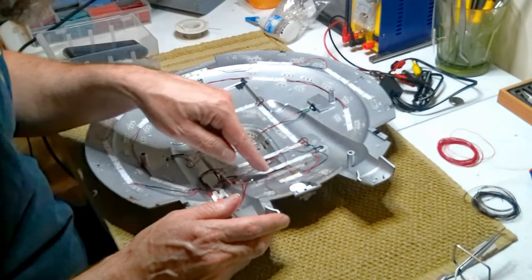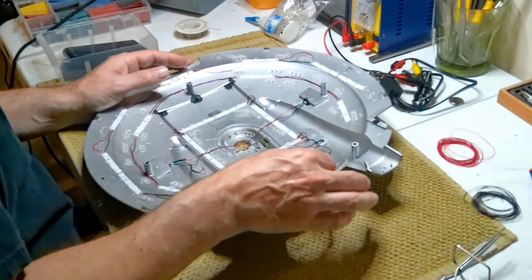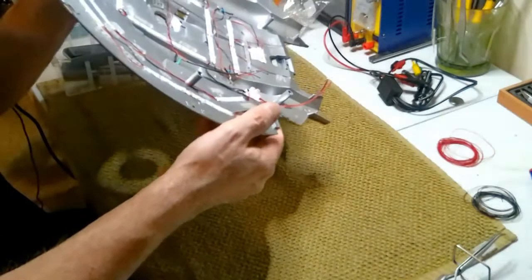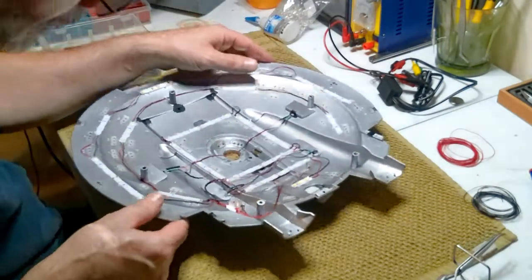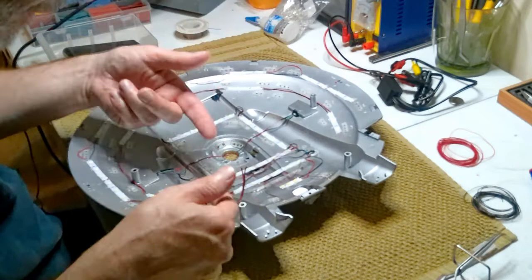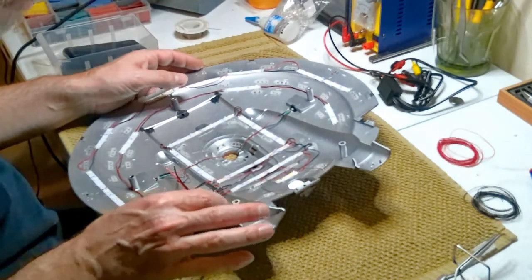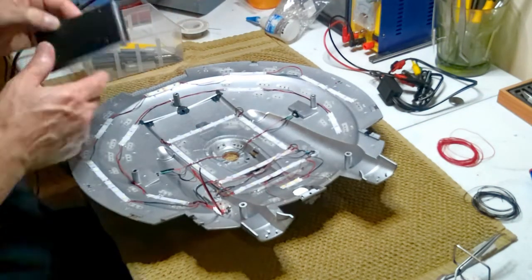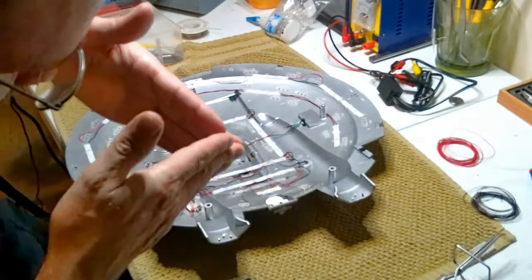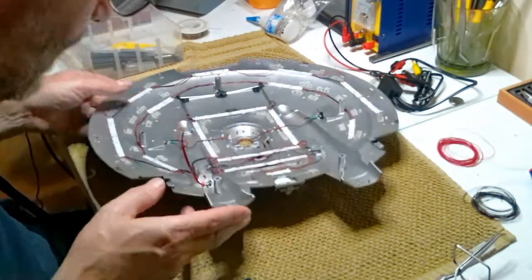This one here, we'll run a separate circuit, unless I jump that off of this. But I think with those two, I'll run a separate circuit. It seems like the more you get under these binding posts anyway, the better it is, because it can fit a pretty decent amount of wire in there, so I want to make sure I do that. And then I can go either way, and then run the jumper between. Doesn't matter, the whole thing's going to carry the power, but oopsie, that one came out because it's just one wire. Doesn't really give it anything to grab onto, because the screw kind of has a point, and the barrel's round, but it can push the wires off to the side.